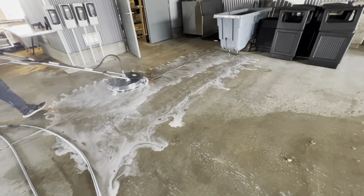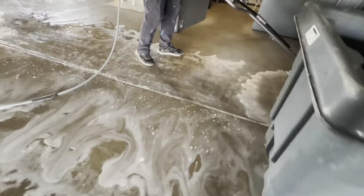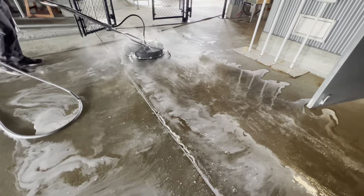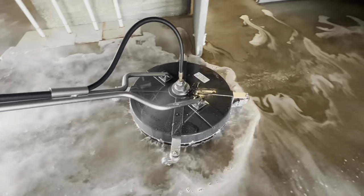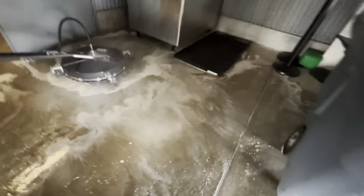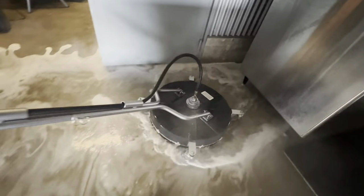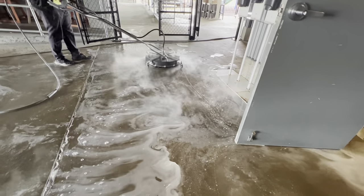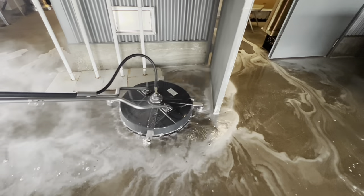As you see here, we're doing a little test with it. I do something a little different — I call it upstream — I add a little Dawn dish soap to our buffer tank. We've done it hundreds of times and no issues with the pump. If you're running a buffer tank, you can add a little Dawn dish soap, and whether you're doing dumpster pads, Sonics, or something like that, that Dawn dish soap being pressurized really works phenomenally. We've had incredible success and we're saving a ton of money not having to buy degreasers that are 30 to 40 dollars a gallon. Dawn dish soap — you can get it at Walmart, any dollar store, Home Depot — and a bottle lasts us several days at five or six dollars.